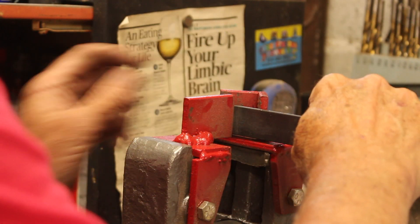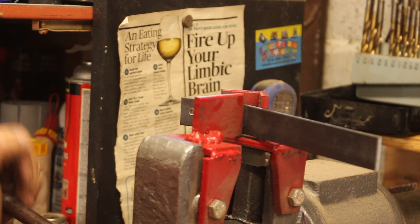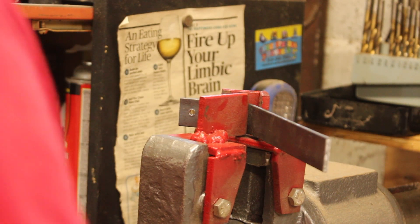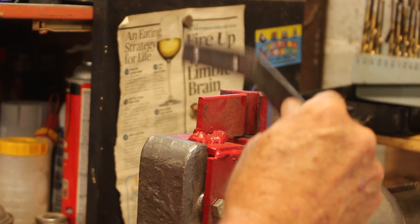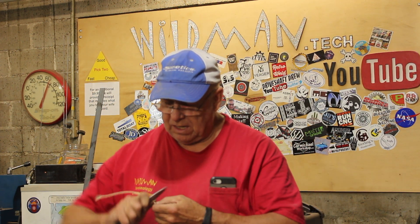I'm not sure how much to bend — I better go check. It looks like that's going to be a good shape. On to the next phase: we have this multi-strand wire that should do just fine to carry the signal from the switch to the indicator lights. I've got six lights, I need six conductors. This wire has eight conductors in pairs — blue, brown, orange, and green. So I will just pick out the colorful ones: the blue, orange, and green. Those are going to be my signal wires.